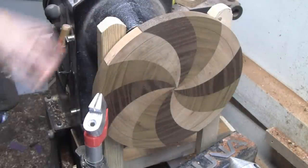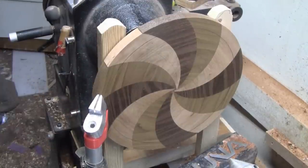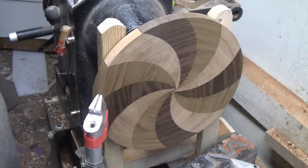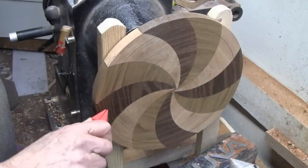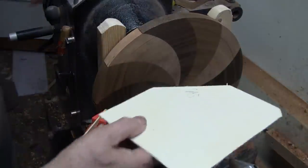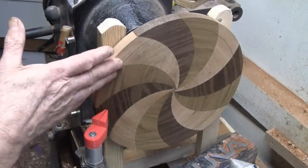Here are a number of things I've designed to help. There's a little support behind there that catches the ring so it doesn't fly off and hit the bed of the lathe. I also use a little jig I made for cutting rings—if you've seen a lot of my videos, you've seen that. I recently 3D-printed one and I'm testing it out. To set the 45-degree angle, a popsicle stick fits in that groove with a template set at 45. I'll cut the first ring and decide how much room we have left—I may change the angle, I'm not sure.